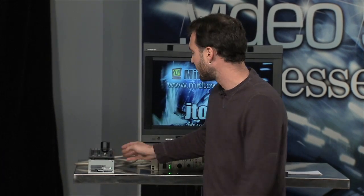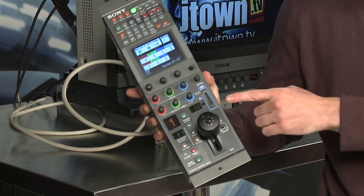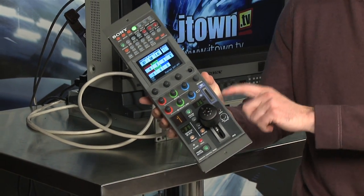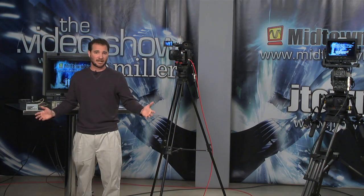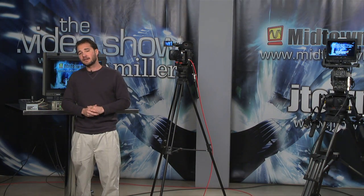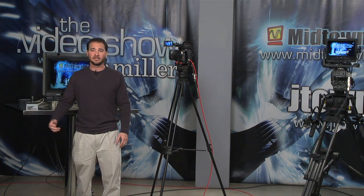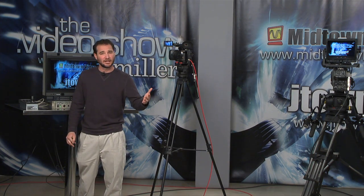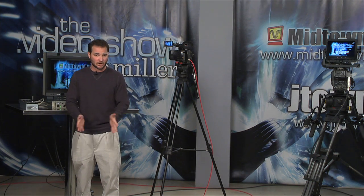Once that's done, either on the camera or on the RCP 750, insert a memory stick into this card slot and save your scene settings. This card can then be used in the other paint boxes, or if you've got a guy walking around on set, in the other cameras to load up the exact same scene file. It may not be exactly perfect, but you are about 99% of the way towards matching cameras. The setup time you're saving is immense — you can really set up 10 cameras in the time it would take to set up two without the memory stick feature.